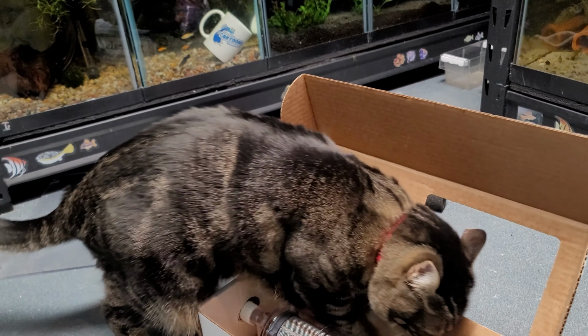Be careful this time with the bandsaw, not to make it crooked. If it's going to be crooked, it has to go smaller. Right, not bigger. Okay, I'll do my best. That mark's got to be your biggest part. Nope, that's upside down. Put the bandsaw right side up. Like this? Or what you can do is you can hold the trigger, right, and put the other side down. Right. No, that's not safe. Oh, like this? Yeah. And then you can see what you're doing. Then do that. And go slow. You can turn the speed down on that bandsaw if it's up too high.